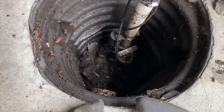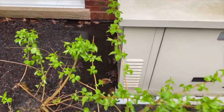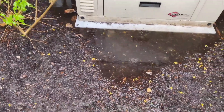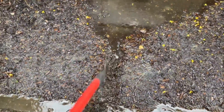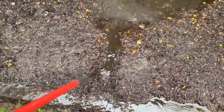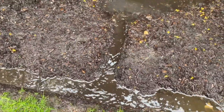On the outside, when it comes to this pooling water, take a shovel or a rake, and where you see it pooled up, try and direct the water away from the home. A lot of us have already added mulch, and it's built up a little bit, and that can hold the water against the side of the house. Just sort of create a little trough to pull it away. Once you see that water start flowing, it's actually quite satisfying, and it will keep the water from going inside your basement.